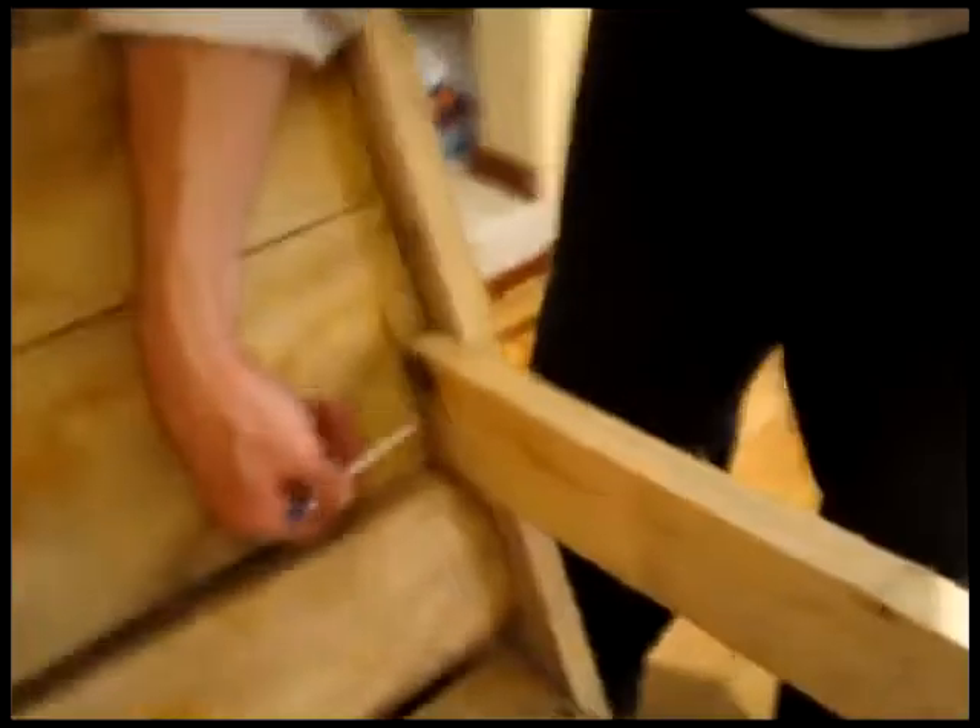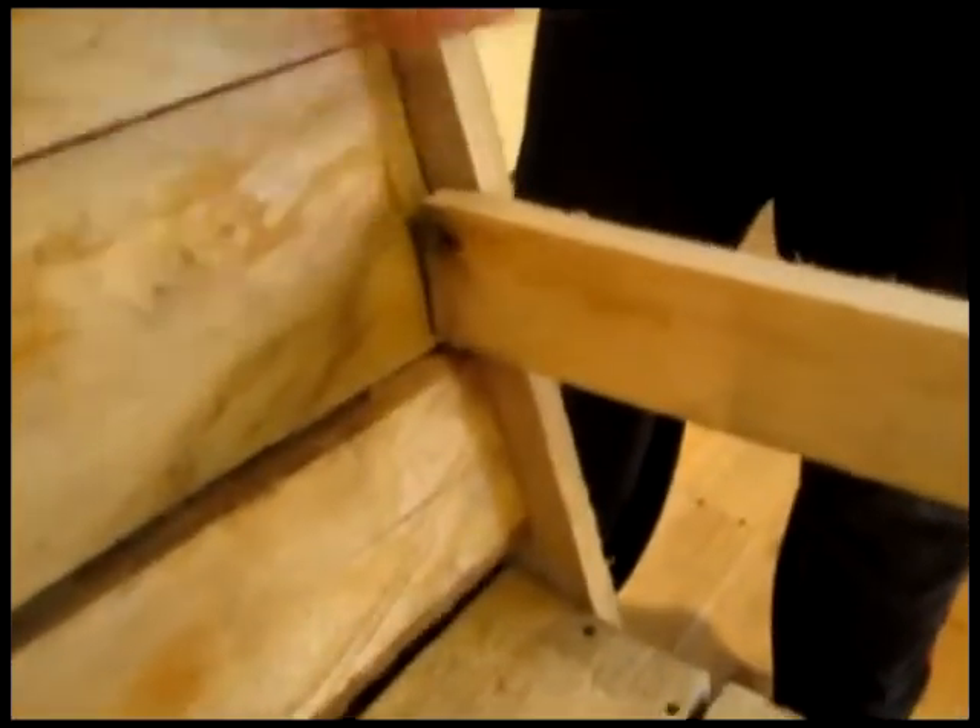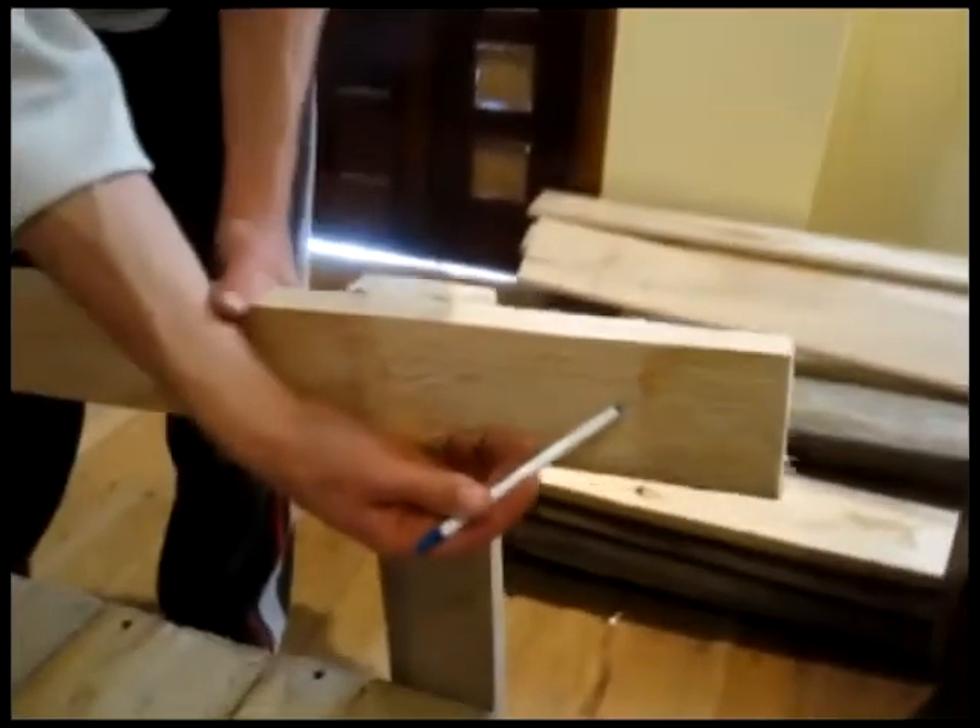You can't see it because we have an arm on top, but it goes in here and that's what supports it. Since there's an angle here and you've got this gap, you cut your wood a little bit longer and then you come to this side — it's angled, larger here and thinner there.